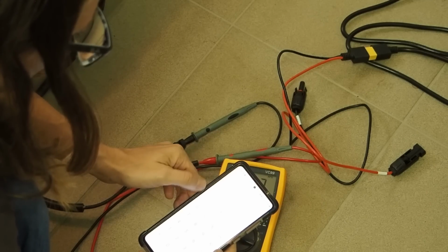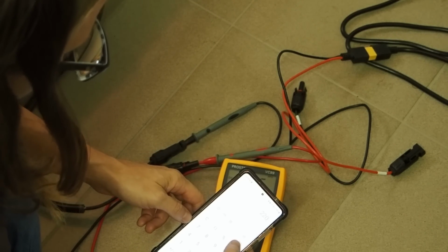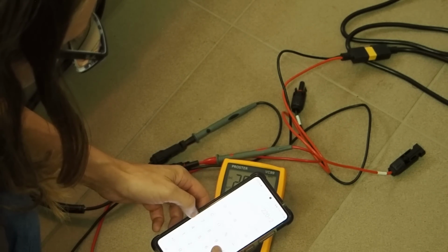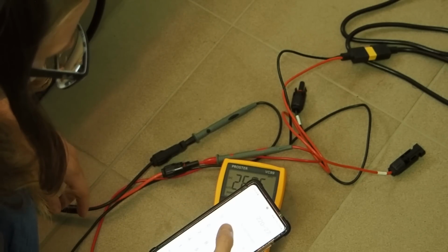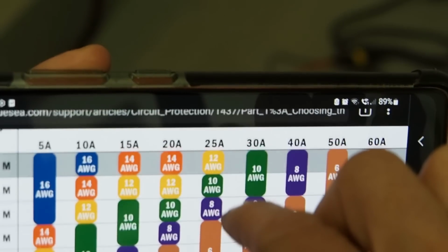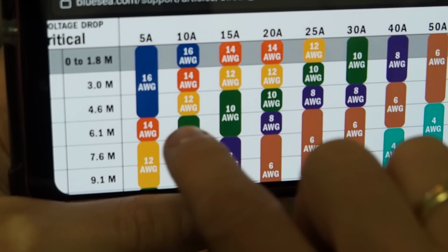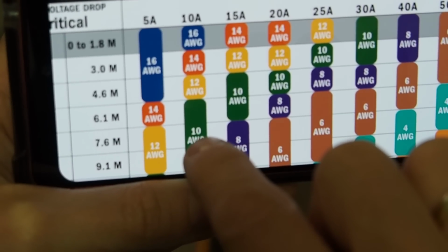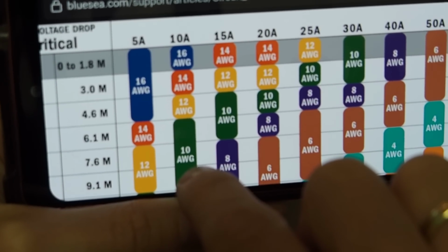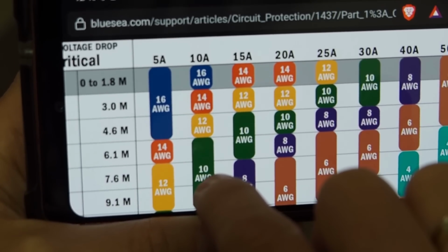Alright. So let's say it's a super sunny day in summertime. We get 220 watts divided by 27 volts, so we get 8.15 amperes. Okay, because we are underneath 10 amperes at 7 meters, we should use a 10 AWG cable. This is what the company Off-Grid Tech is offering.